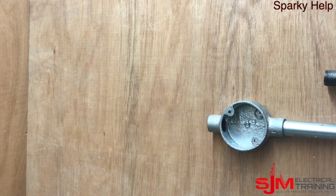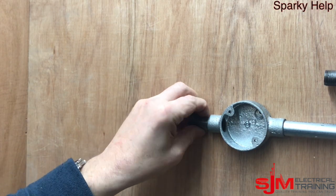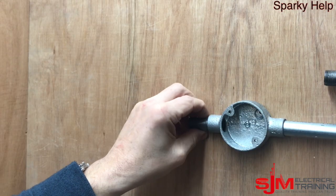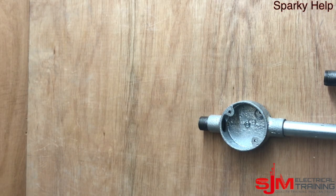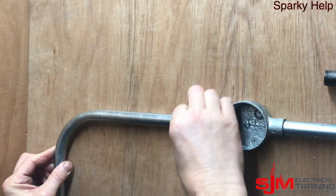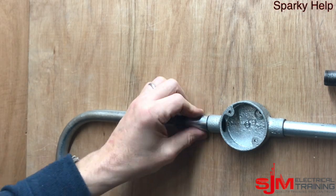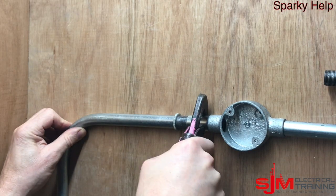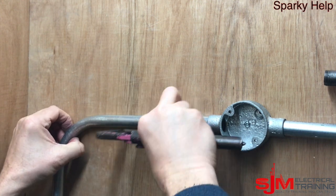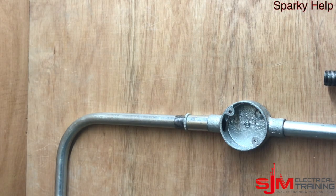So there we have our spout — obviously we can't turn thread into that unless we take the whole thing down. So we put our nipple in, screw the nipple in, so you've got roughly half a coupler sticking out. Now we can offer that up, and what we do is screw the coupler over the nipple, ensuring you've screwed it on so far there's no thread showing, and tighten that up. That coupler will be tight, but the conduit you put up will be loose — and this is where the lock nut comes in place, because you tighten the lock nut up and that will ensure your conduit is now tight. Just make sure it is all straight.